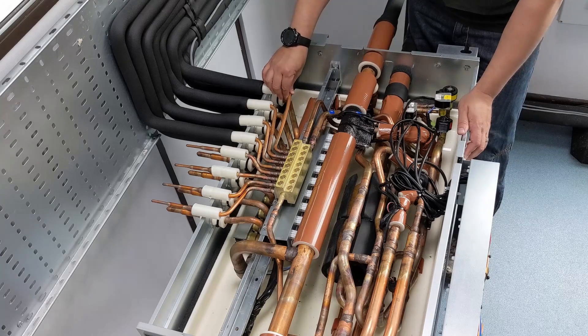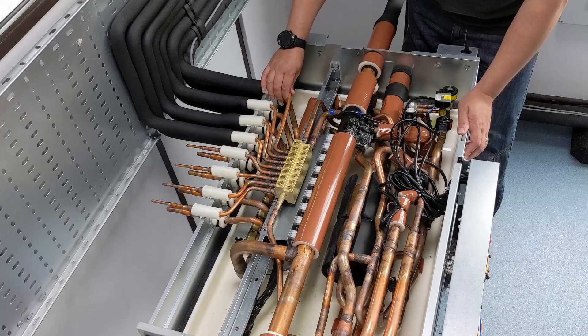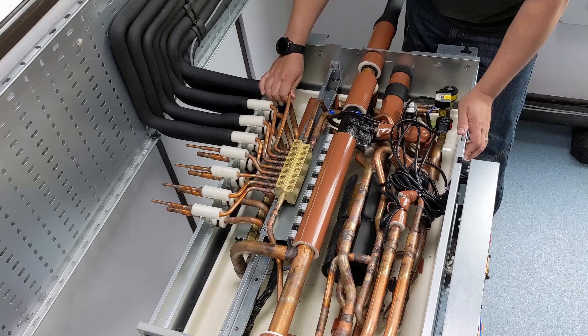That refrigerant is sent off to the indoor unit through the expansion device. We've got that big pressure drop, at which point it's trying to boil at around zero degrees evaporating temperature — that's how the compressor is being controlled, targeting zero degrees evaporating temperature or around 7.2 bar.